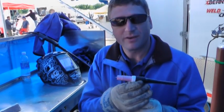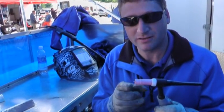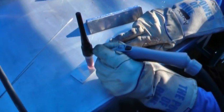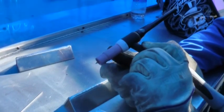One way to rectify that, especially when you're welding material that isn't perfectly clean where it could draw some contamination to the tungsten, is simply by taking the tungsten and scratching it slightly on something or on the piece you're going to be welding. Scratch it slightly and that will expose a little bit of clean tungsten and allow for a more positive arc start.